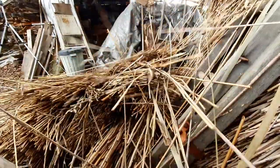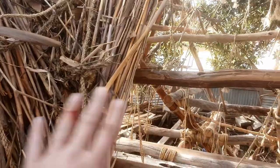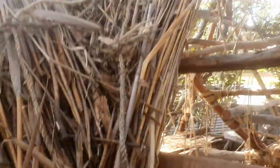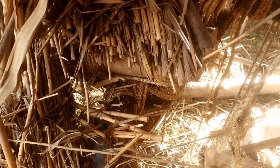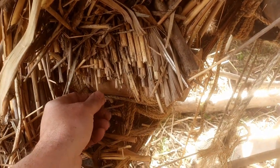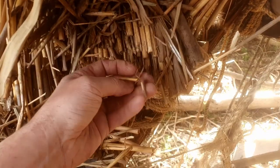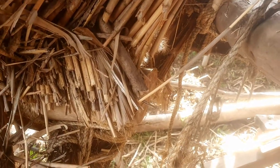We're now well into the gutter and found some interesting stuff. When I laid the reed, I laid the flat sections on the gables and then tried to blend the gutter in. That let me take off the reed on the outside and left the gutter in place. There are signs moisture has been getting in — you can see dirt in there and that's mildew. But it has fared a lot better than the rush, because the reed is less absorbent, doesn't hold as much water, and dries out faster. The structural integrity isn't great, but it hasn't rotted — maybe a little brittle in the gutter. I still think it wouldn't have lasted the full 20 years, but maybe it would have lasted 10.